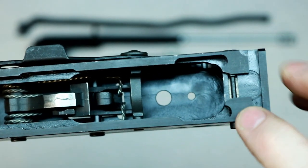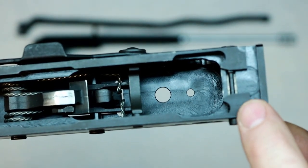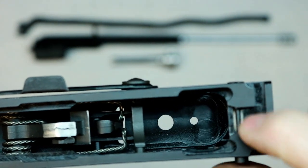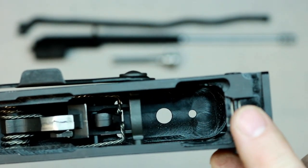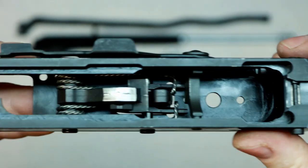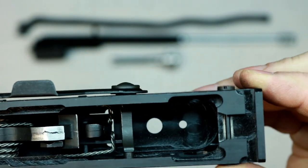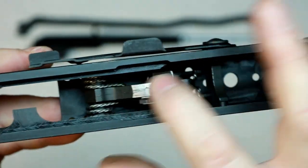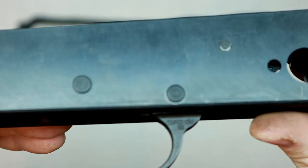This one's a hard one to drill because once you drill out of this solid piece, it goes into half and half. Half the drill is in the material, half of it's out. You gotta go real, real slow or it's gonna want to push out on you. And it may still do it a few thousandths. But this one seems to work all right. You see, I got a Tapco in there.